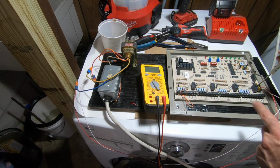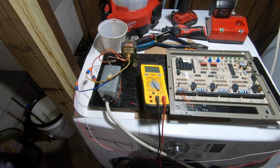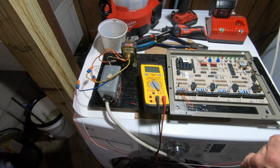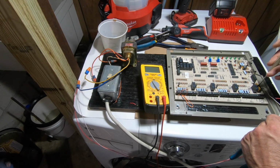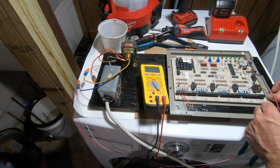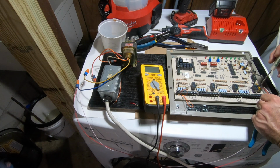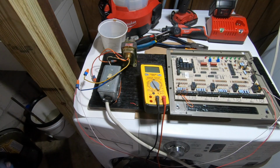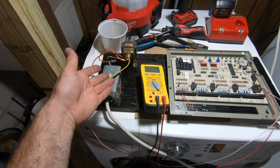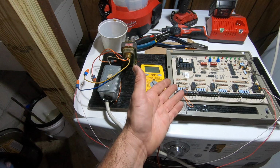But let's see if even though I released the factory smoke out of the transformer, I may not have killed it. I just maybe angered the dragon just a little bit. Not enough that he's going full rage short, because he would pop this. I have no commons on the board, but obviously there's commons. How hot? Oh yeah, it's a little hot. So what I'm gonna do is take a 5-minute break. I'll be back. I'm gonna allow that transformer to cool off and then see if that transformer can juice the board and if that's where I'm going wrong.